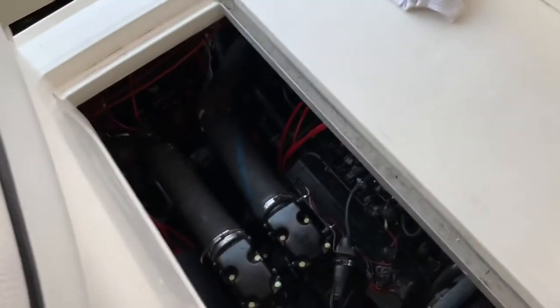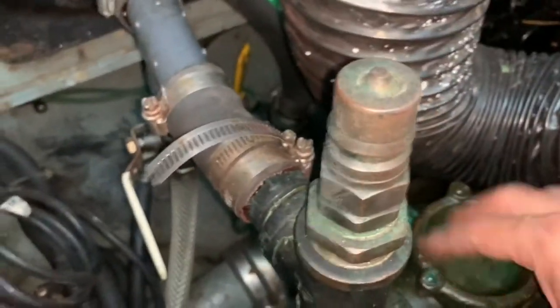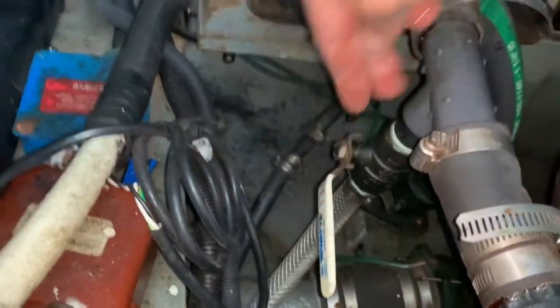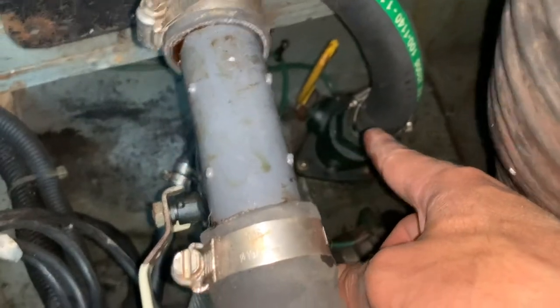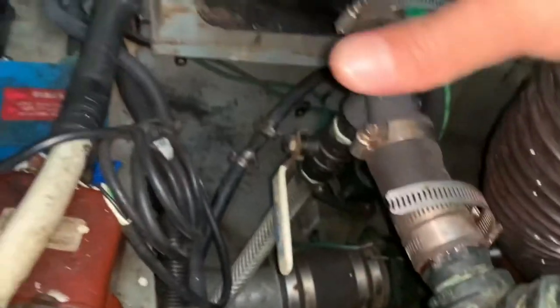Let me go connect the hose. Let me see if I can show you guys this. So this is my filter right here — it's all copper, that's oxidation, not rust. Then this is the T: the hose connects here, goes under there, comes back to this T. And there is my seacock from the ocean. From that point on, with the hose connected here, you can never trap the water inside the system.